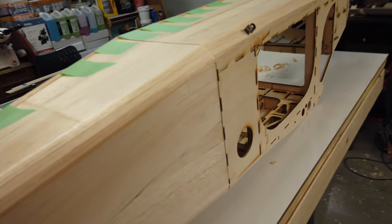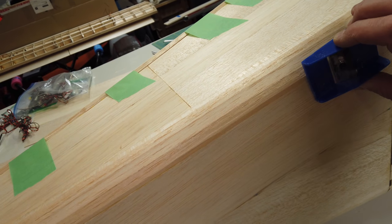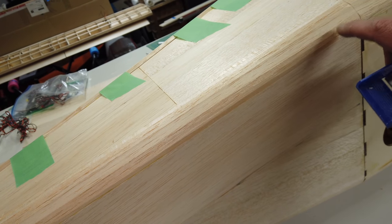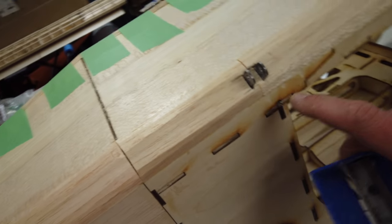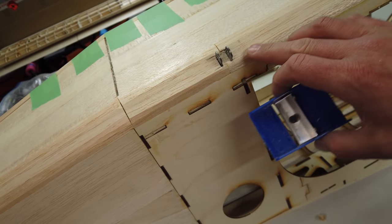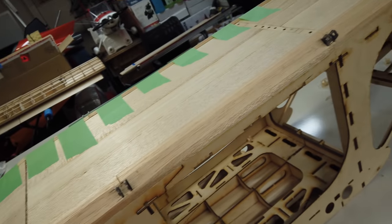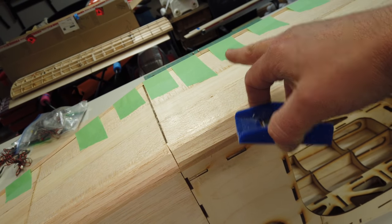One thing I've started doing on this top section is rather than just doing my 90-degree passes, I've gone in and done a couple passes at different angles to get rid of the material here - it means less sanding and less dust. You're avoiding the center part which is going to be at full height. It's a bit of a pain to work around the float mounts, so I'm doing the center section and the float mount areas will have to be all sanding. That spot in between that we filled in is going to be a pain as well, but ultimately it's going to look good - a nice finished product. One side's done, ready to do the other side.